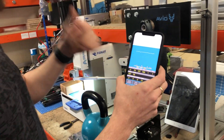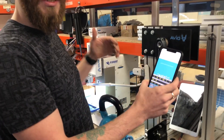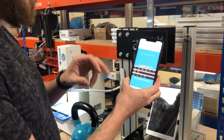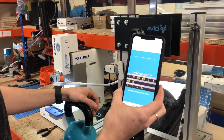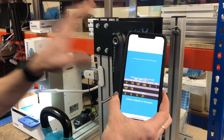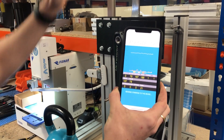At this stage we're going to teach PowerSense what no load is and then what a specific load is — in this case 10 kilos. We tap 'Zero Offset' and wait an obligatory 15 seconds while it sends the command to the device. At this stage we're just saving all the values that correspond to nothing — no load.